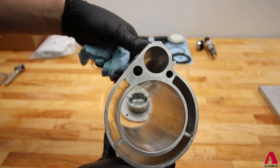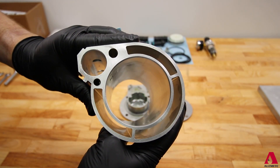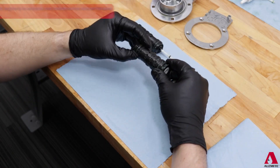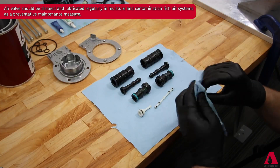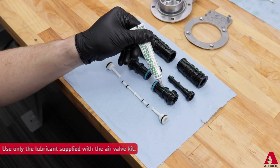Examine for any excessive wear to the bores. We do not recommend sanding or buffing of the bore — replace any of these components if damage is found. The air valve spool can be further disassembled, cleaned, and lubricated. If the air system has a particularly high moisture or debris content, creating a cleaning and lubrication schedule will help these motors last a significant amount of time.